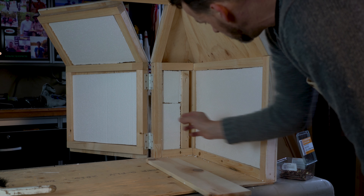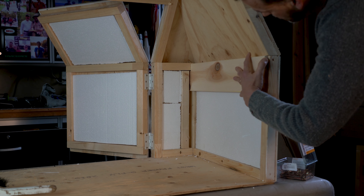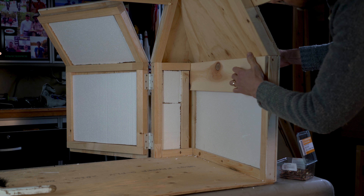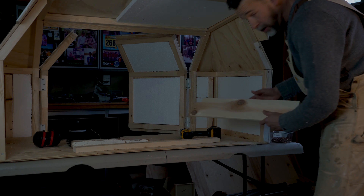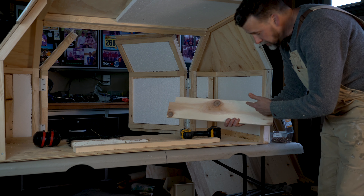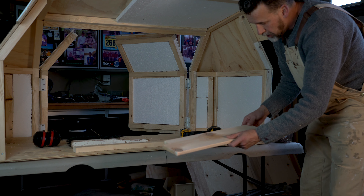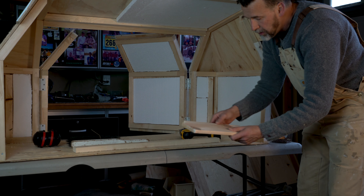When I was framing this I forgot to put a second stud here — I just had the corner one and wasn't going to have anything to nail the cedar onto that side. So I added a piece with a gap in between so the cedar will fit onto it for support and stability. Also, since I'm screwing the cedar close to the edge of the board, I don't want the screws to crack the wood. So I'm going to pre-drill the holes — if you just put the screw in near the end of the board, especially with cedar, you're going to pop and split the wood.